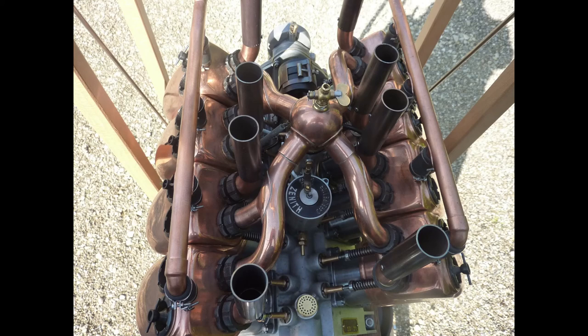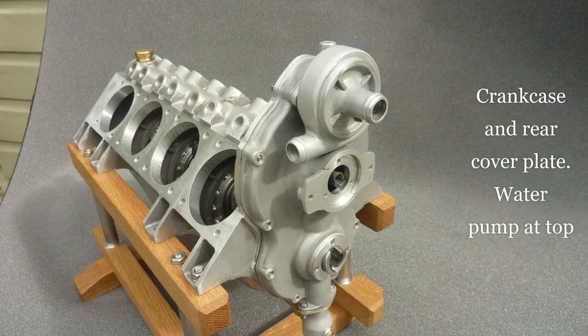It has a one-piece crankcase with a crankshaft supported in ball bearings. This was not unusual in those days when it was thought that ball bearings were the coming thing. We now know better, for piston engines don't really like them.